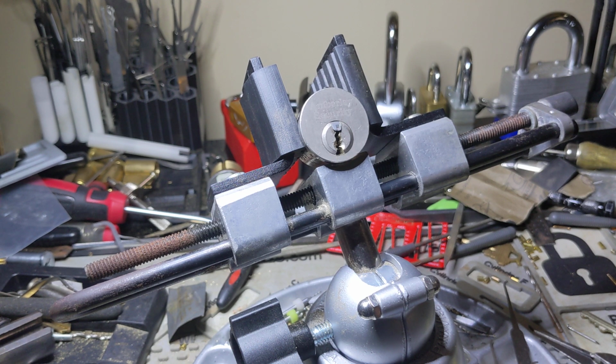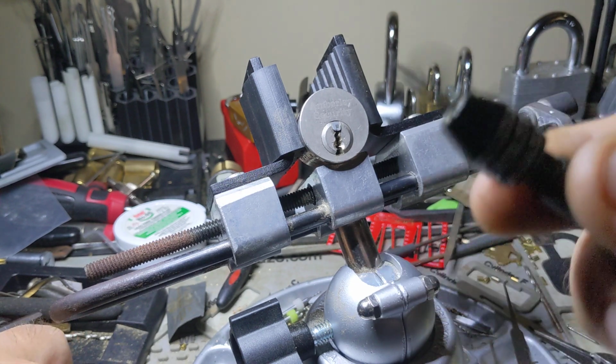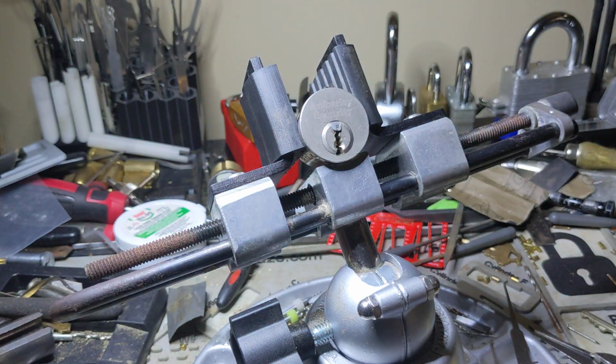That, I guess, pretty much concludes everything I could think of that I left out of the first video. I've had my learning curve. I made my mistakes, and I'm trying to make sure that people don't make those in the process like I did, trying to get in too much of a hurry and get too many things done, namely breaking your tap off into your tube by using the Dremel. No. It's best to do it by hand.